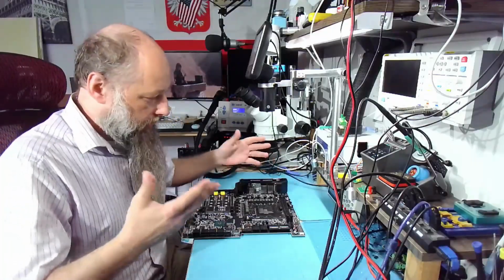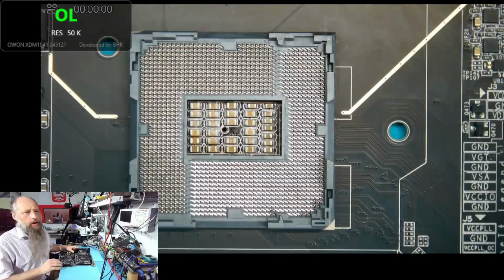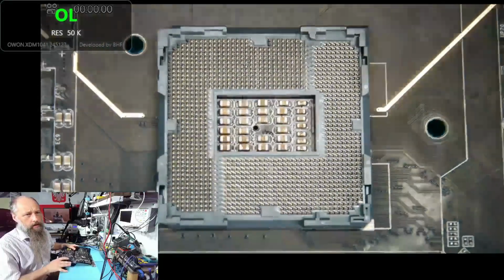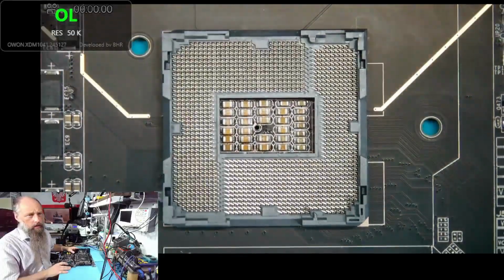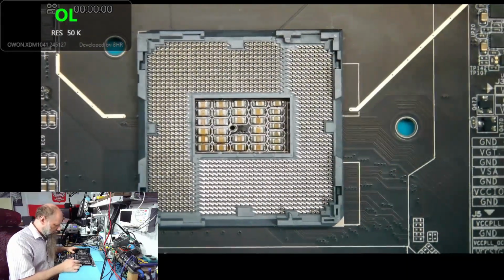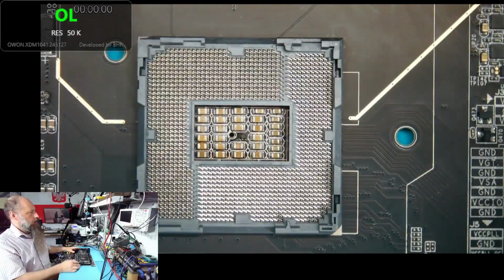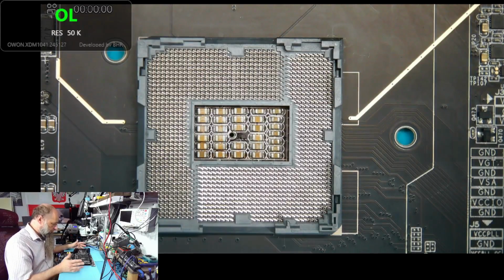And we're done. This went pretty well. I didn't see when the socket actually dropped, but it seems solid. It is aligned and it is nice and clean. It looks good. I'm not sure if it's because of the flux I can see when they drop, but I don't know. I kept it a little longer on 205 than I normally do, just in case.